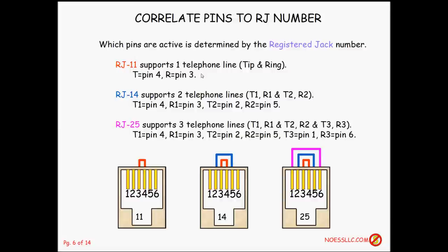A lot of people get concerned about whether mixing up the tip and ring makes a difference. If you have a dial phone, it doesn't matter at all. Really old touch tone phones were polarity sensitive, so you had to get it right or the touch tone pad wouldn't work. But modern phones — dual tone multi-frequency DTMF — don't care. So most of the time it doesn't matter if you mix up the tip and ring, but you do have to get the pins correct. It's nice to keep the color code straight anyway.